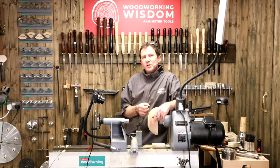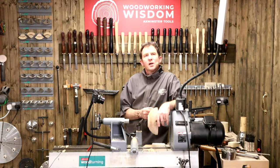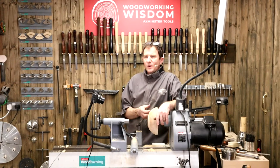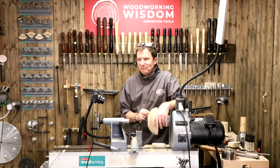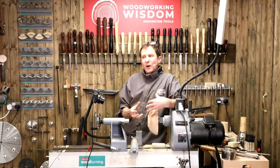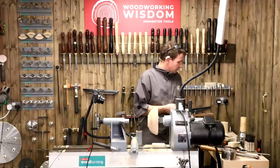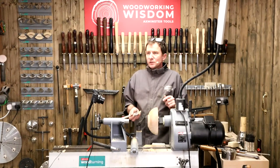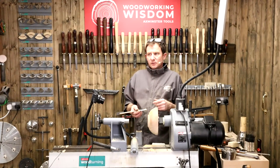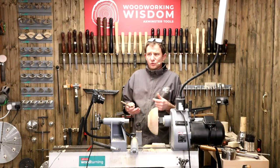Brass brush. The problem with the brass brush, if you've got softer fibers in the material, ash is a good example, you'll brush out those fibers. So as much as you'll clean up the effect, you're also damaging the grain around it. So the hog's hair brush, being all bristled, will remove the fluff, but not damage the soft fibers in the wood. Spring growth, if you really want it, is a technical term.